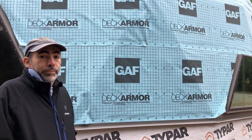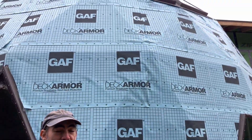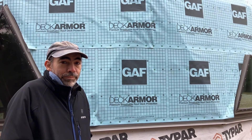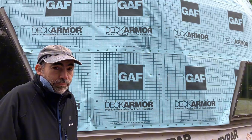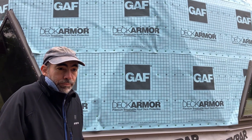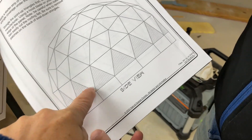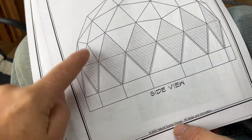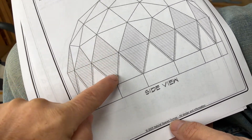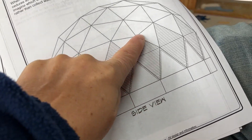Roofing a dome is a little bit different from a standard roof. Lots of cutting involved. There's a specific pattern that the roofers will follow — each triangle is basically treated as a separate mini roof. Here's a nice picture showing the order of the shingles going up. So we'll start with these guys, then we'll do these, and at the same time they could go this and this, this and this — they can go zoop, zoop, zoop.